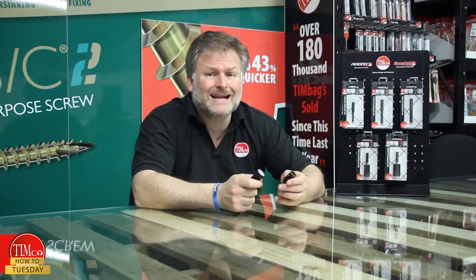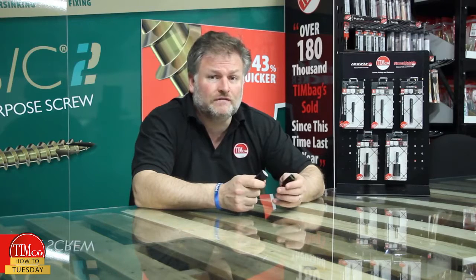So there it is. Our diamond drill bits will easily drill through many materials, including grade five porcelain tiles up to 20mm thick. Take care when using them, as the bits can glaze and burn out if used too fast. Click below for a full list of recommended RPMs. That's it for today's video — see you next week for another Timco How-To Tuesday.